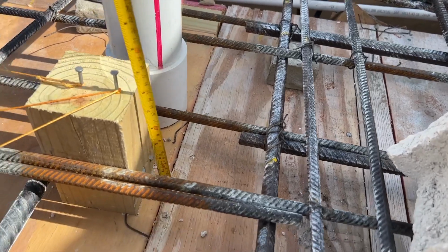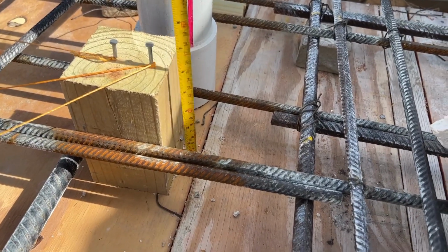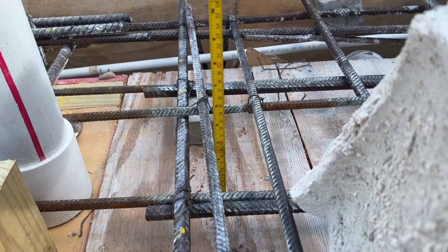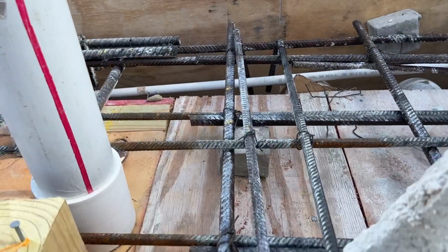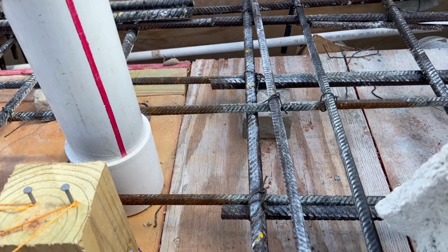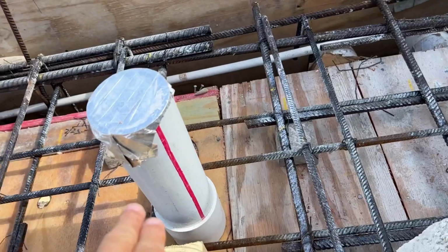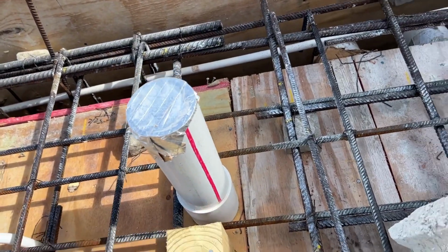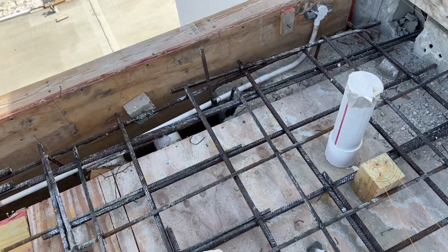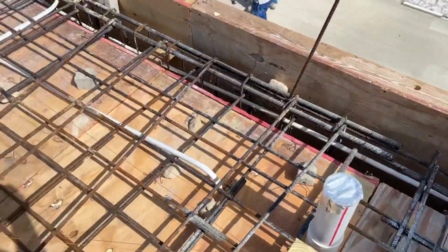But anyway, we're going to be doing it to here anyway. So we're at 6 inches. So we've got 2 inches of play above those. So that should be absolutely fine because it'll only be about an inch. And then we'll put a lot of treatment in that. So we'll put a lot of rubberization in there, and I'll put some fiber into the actual holes themselves and rubberize that in. So that'll be a whole rubberized gutter that will collect.